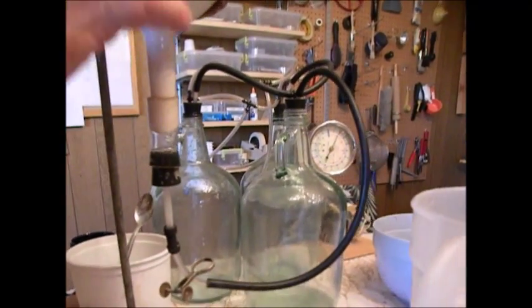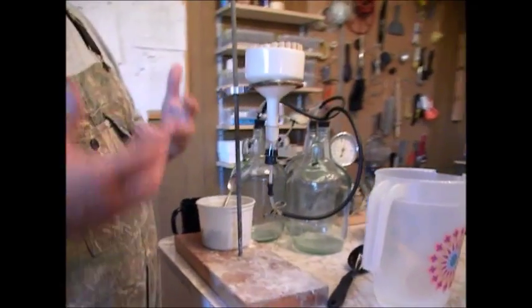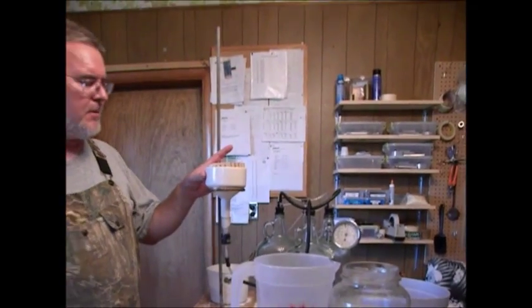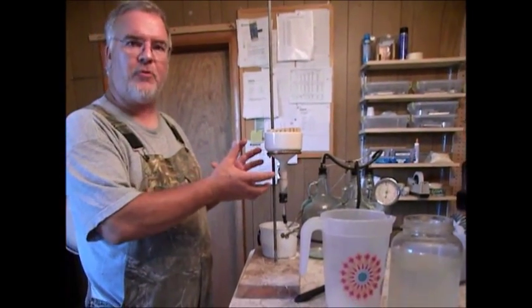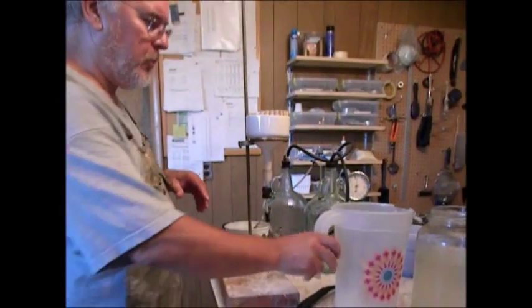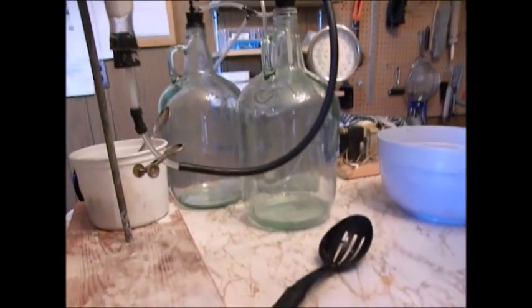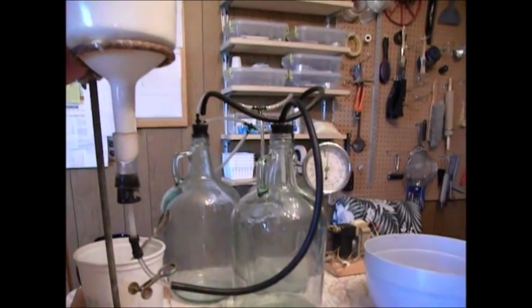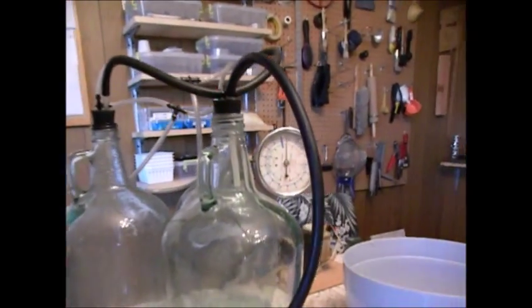It's kind of up to you how long you want to let it draw a vacuum. The longer you let it draw a vacuum across it, the drier it's going to get. I guess it depends on where you are in the process. I'm not going to let this dry overly long simply because I'm ready to do my purification process with all the chlorate I've done. It really doesn't have to be dry because I'm going to be putting it into distilled water for its first purification cycle. But typically if I want to get it really dry, seven to ten minutes to let it draw a vacuum across it. I don't know if you can see it, but it's still dripping some water out of it.